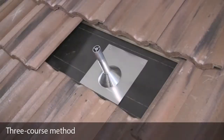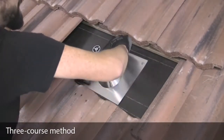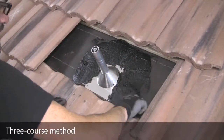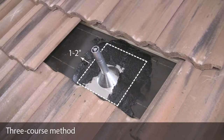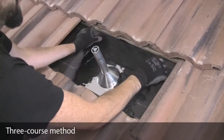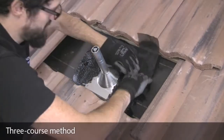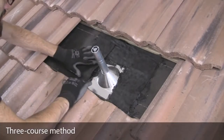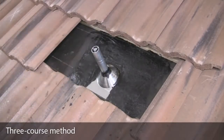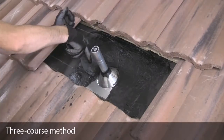If approved by the local building official, another option laid out by the Tile Roofing Institute is the three-course tar method. After laying down your deck flashing, place a layer of roofing cement around the flashing, leaving the bottom end open for drainage. Make sure to extend past the edge of the flashing by at least 1 to 2 inches. Next, lay down a course of mesh fabric strips approximately 4 inches wide on top of the tar, making sure that these strips overlay the edge of the flashing. Cutting all the felt strips you'll need beforehand will make the installation go a little faster. When the tar is dried, apply one or more layers of roofing cement over the strips. This completes the three-course method.